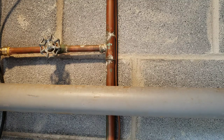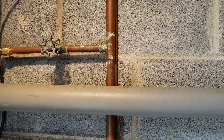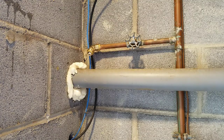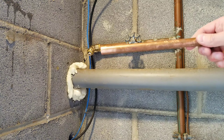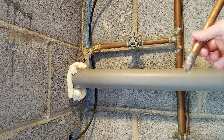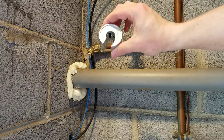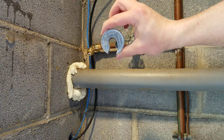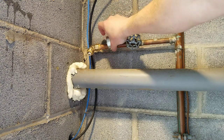Your first step is to locate your shutoff valve and go ahead and turn the water off there. Then open up your existing hose bib and let the water drain out. Your second step is to remove any pipe that actually needs to be removed. My copper pipe had three 90-degree turns that led it out to the hose bib outside, so I chose to remove the copper pipe right after my shutoff valve and cut it using a normal half-inch pipe cutter.